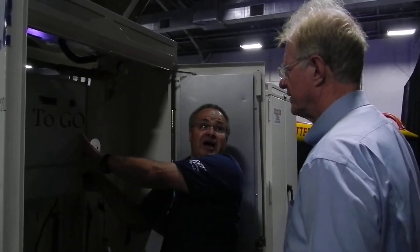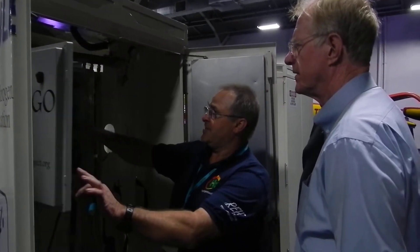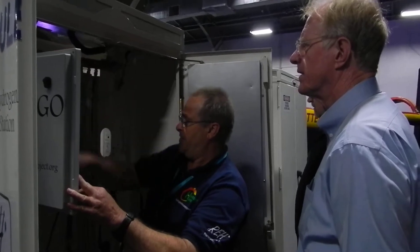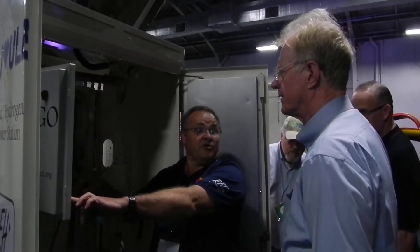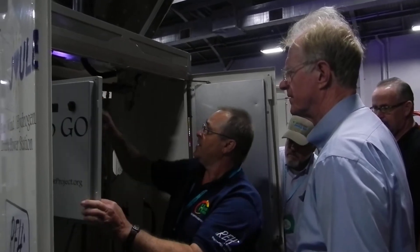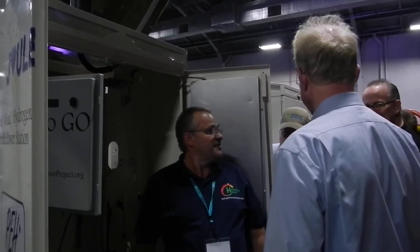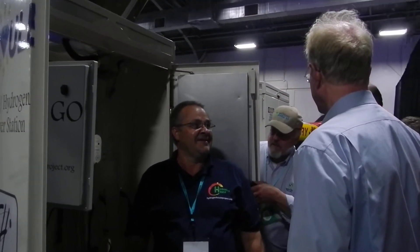This is only 200 pounds, so it's very low pressure. This unit I built uses electrolyzers — we take water, it fills this tank. There's a big tank that sits up here. The electrolyzer splits water into hydrogen and oxygen, puts it out at pressure, through a water separator, and at high pressure into the manifold bank, and fills all the tanks. The fire marshal forced us to take the empty cylinders out, even though they were nearly empty — they had a quarter tank full.